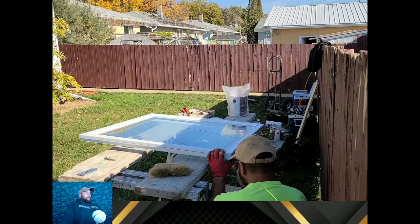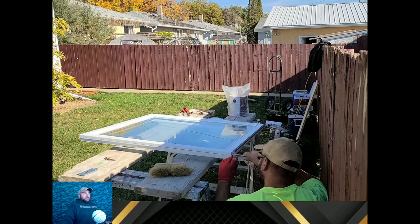You're going to see me reinstalling the weather seals. Once you put the window back in, it doesn't slide all the way back up, so you're going to need to take about three-sixteenths of an inch off — you don't gain all that clearance back. You'll have to sand some off and you may or may not be able to reuse these weather strips. Honestly, I had quite a bit of trouble finding these replacement strips — you're not going to find them in big box stores for old wooden windows, so I'm not sure where you pick them up. That's pretty much it.